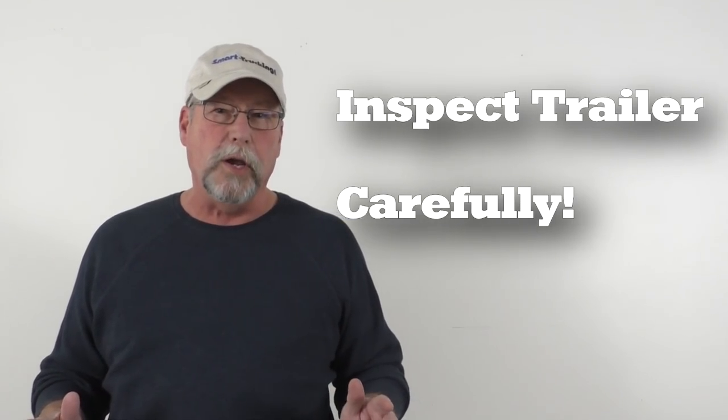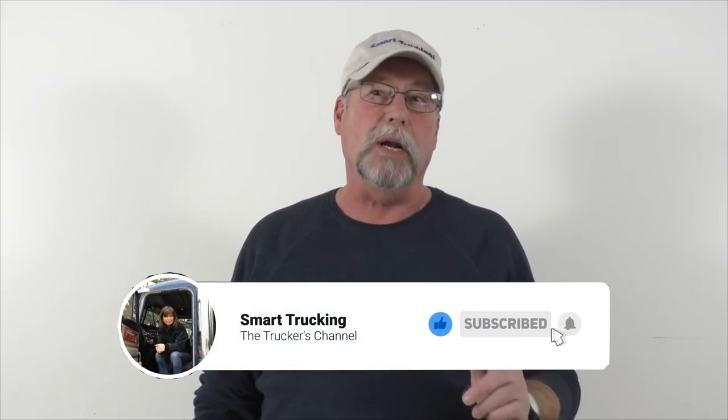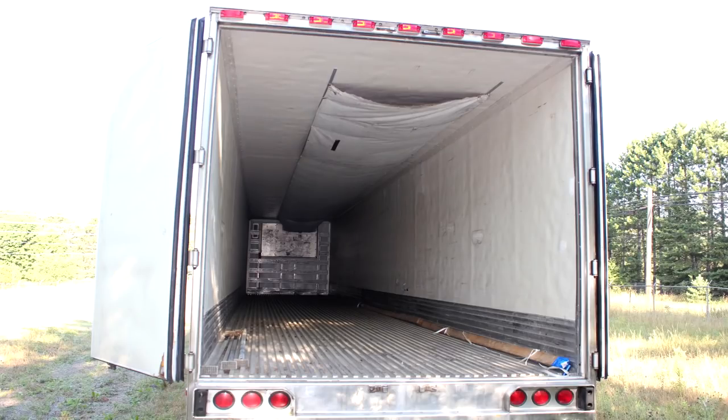Check out the trailer carefully before you go to load. The first important step is to check the trailer — it has got to be clean. Hopefully the company has power washed it out for you, so the walls are clean, the floors have been swept out clean, the drainage holes at the back corners are clean and devoid of wood chips, and you want to make sure the reefer chute up at the front is attached to the reefer unit itself and that the chute's in good order so you'll have airflow right to the back doors.